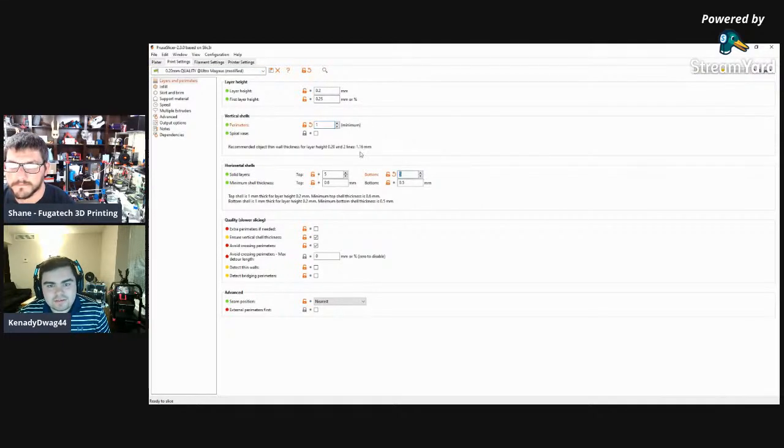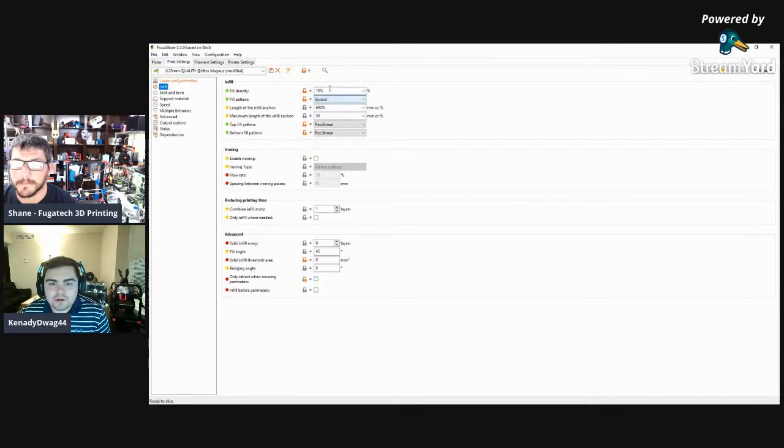Yes, and then your layer height is 75% of your nozzle. Oh, okay. So that would be 0.3. Oh, no, yeah, 0.4. So yeah, 0.4 would work. So 0.5. 0.375 is technically what it is. Okay, it can be anywhere in between that. Your first layer height can stay. I'll just do it a little bit thicker. Okay, and then no top layers, and then no infill. So it's like a one wall cube, pretty much.